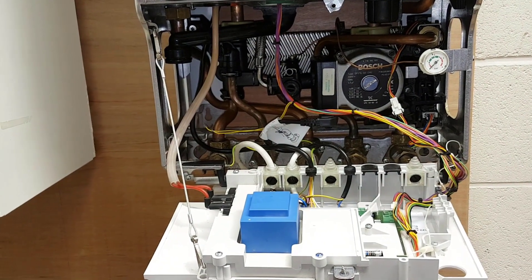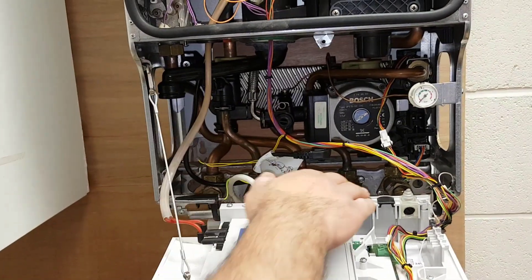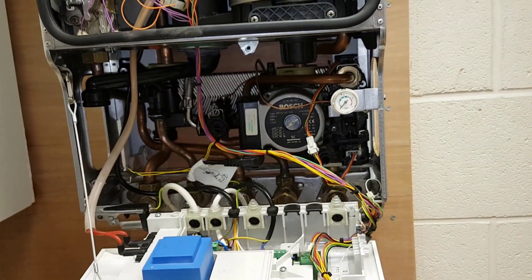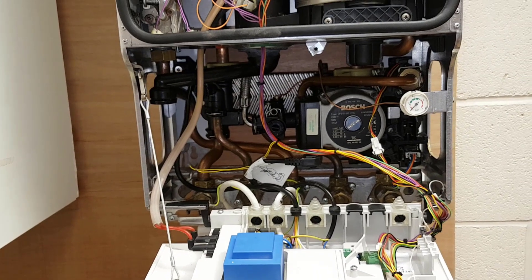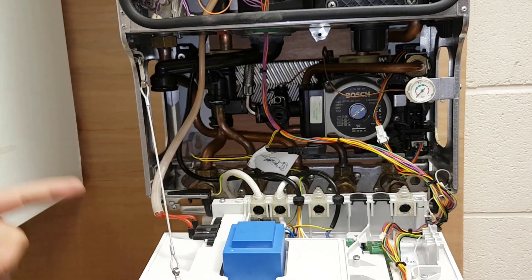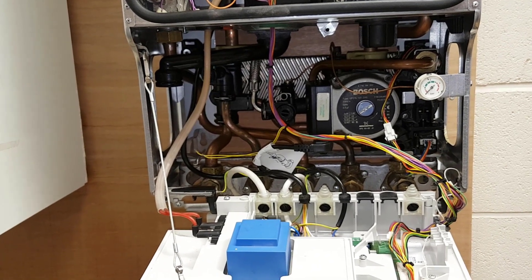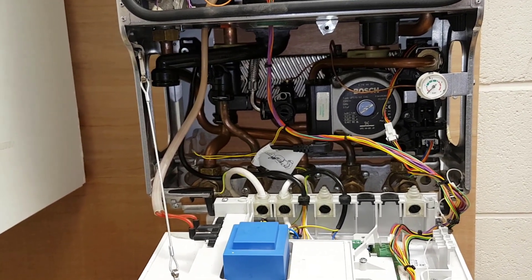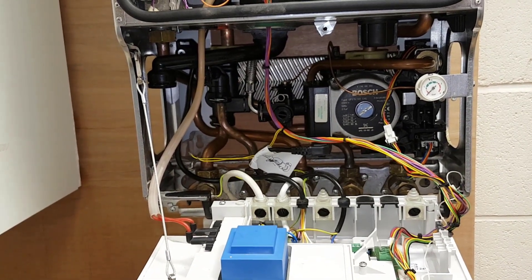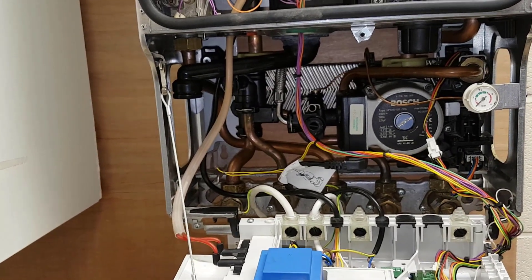Christopher, what would you do next? I would close the hot tap. Yes — close the hot tap. Check drain points. Before I open the water, let's start filling the system. First, open — no, first I would do the water, just in case there's a leak. So what are you going to do then? Open it really, really slowly — the mains inlet. So you open that slowly, make sure everything's OK, no leaks there.